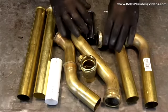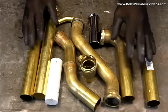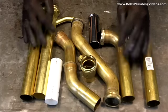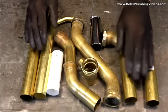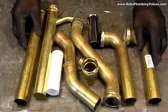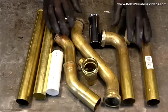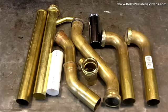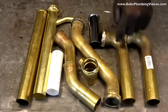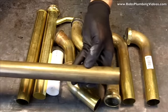That's basically a few methods of how to make the transition from the p-trap to the strainer. In the next segment I'll lay out a couple of p-traps and a strainer and explain how I go about getting from one to the other. They also make slip elbows — I'll take this out of its sleeve so you can see it. They make them from 8 inches all the way up to 24 inches. I'm going to pan by the camera — you'll see this is a 24-inch waste bend.